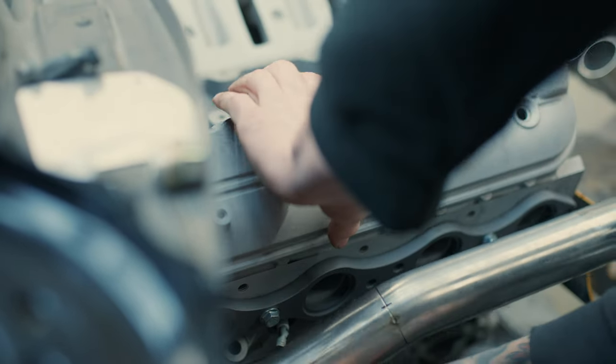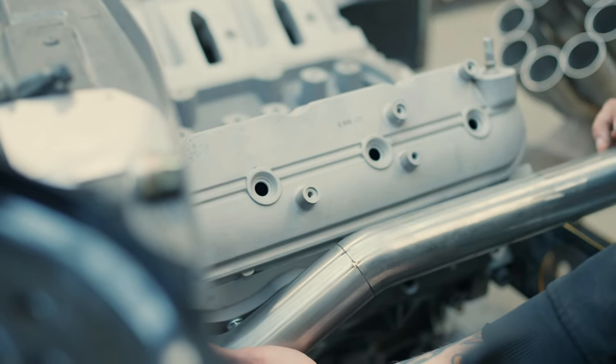Silver 80L cover. I'm going to be running Frankenstein heads. I think I talked about this, how they move. They align the headers and the ports by moving basically where the threads are for the flanges. So we had to mill the flanges to simulate what the Frankenstein heads are actually going to be position-wise, because we don't have them. As you can see, these are boat anchor heads that we got from Cam. Right now, we're doing the first two runners going into the collector. This is going to determine the path of every other runner. That's what we're doing.